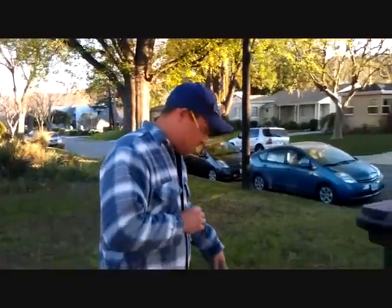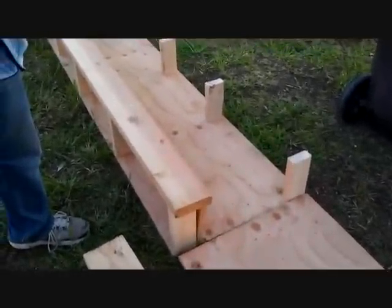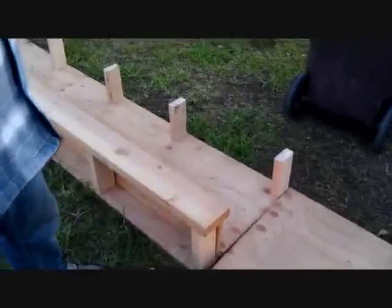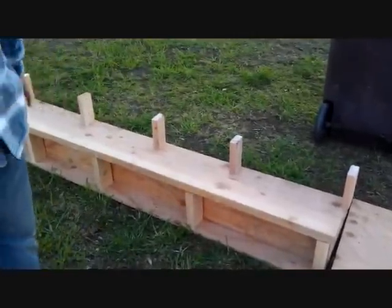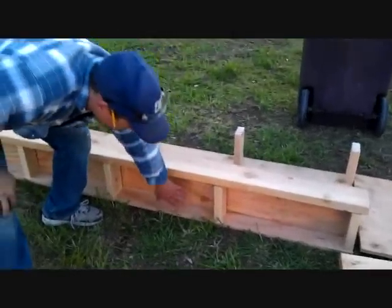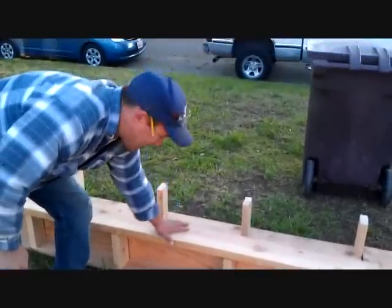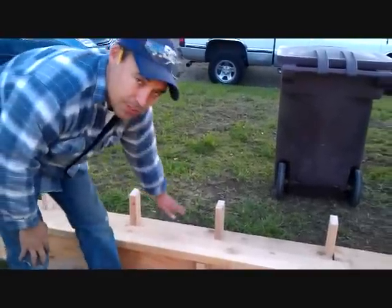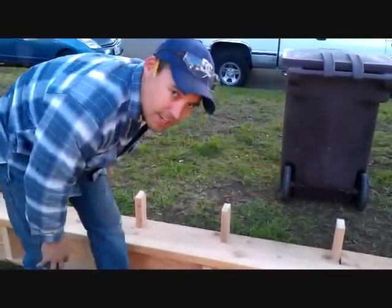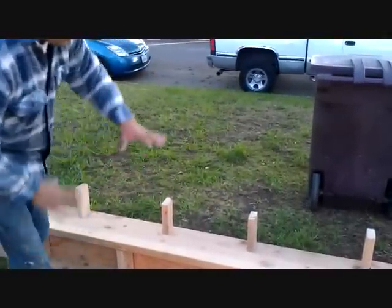Okay, on this one over here, this is the sluice that the kids are going to actually be gold panning in, or out of. And we have to make 8 of these, a total of 64 feet. And we're going to make basically a gigantic horseshoe shape. The plan for this was, I've got 3/4 ply, I've got an 8-inch sidewall with some 2x4 bracing. It's gonna have a 2x6 cap on it. And then I'm gonna do a double layer of plywood and offset it. So basically I'm gonna overlap all my seams, so it'll be pretty leak proof.